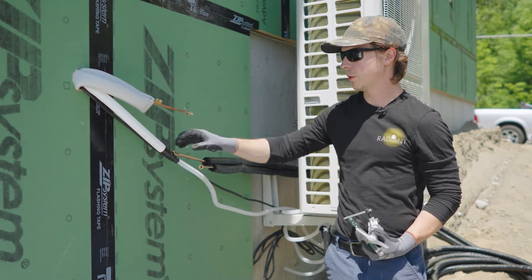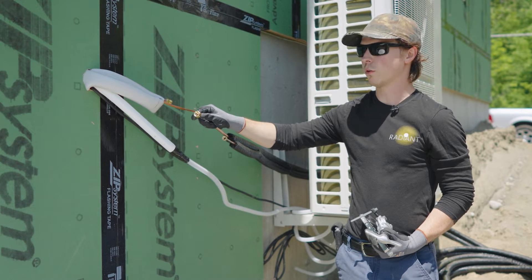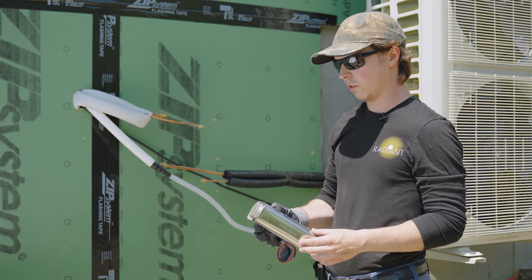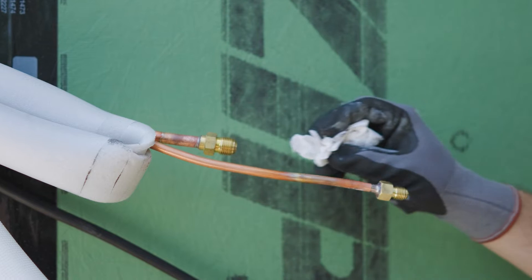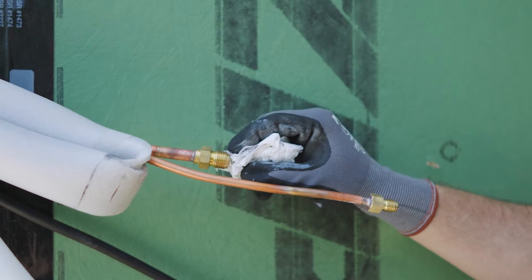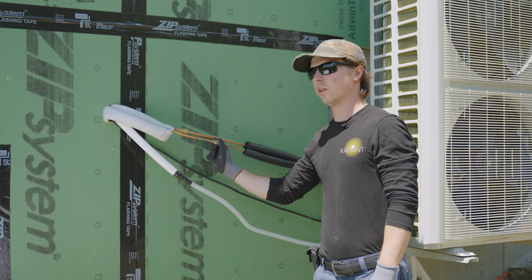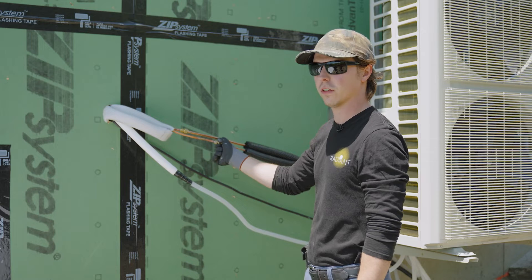After this, apply a little bit of refrigerant oil to the ends of the flares. Based on the refrigerant you're using, you may need a different type of oil. When applying oil to the flare nuts, make sure you only apply it to the face, not the threads themselves — oil on the threads can prevent you from achieving the correct torque.